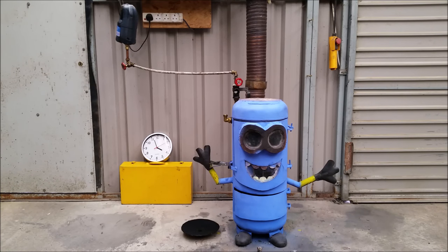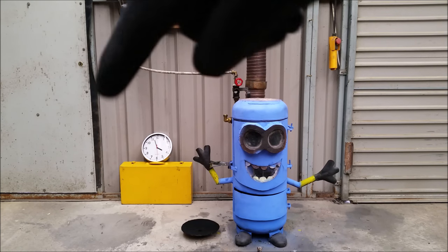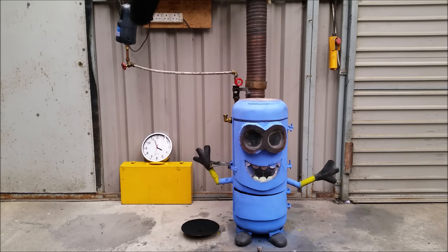And I always say 2, 3, 4 litres an hour, and because it is variable you can up and lower the rate. To get a reasonable amount of heat out of the stove, we are going to see how much it takes to burn. This oil line is empty; there is 2 litres of oil in this container here, and we are going to light it and see how long we get out of 2 litres.